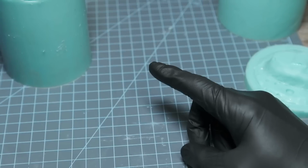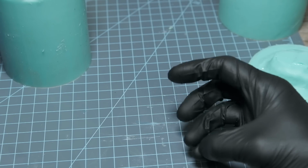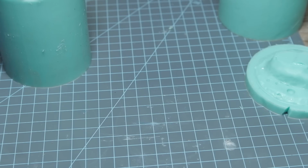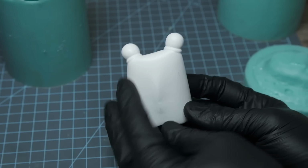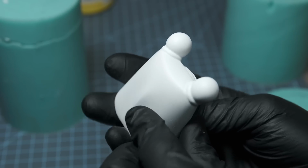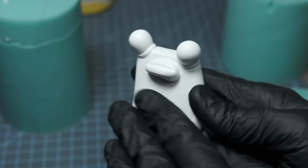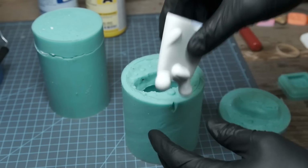So here's what I did. I took my same object and I went over that thing with several coats of a primer, a matte primer, so that I could maintain the matte feel of the object, you know what I'm saying? Here, let me clean my hands off before I handle this. Get the focus there. There we go. So look at that. It's nice and smooth. I was all excited. So this is a matte primer that I put on that thing. I said, oh, this is gonna work real good now, because the 3D print is all sealed up.